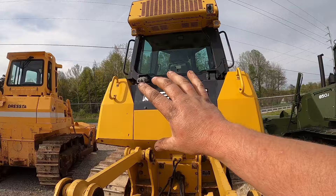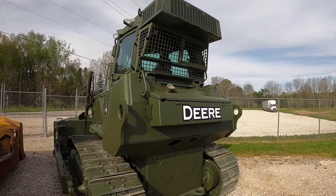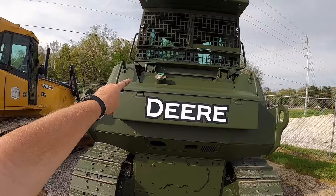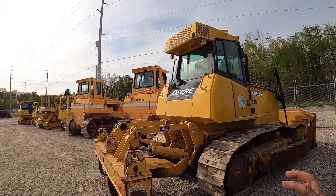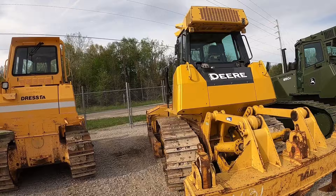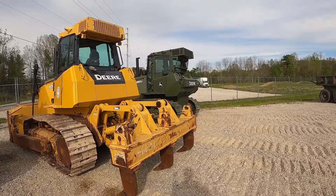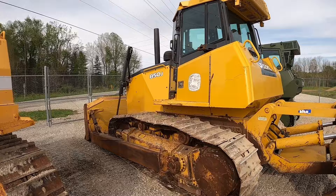Another difference is the fuel tank. On the military unit the cab mounting bolts are welded to the fuel tank, while on the civilian one they're bolted on. The reason is that armored cabs have a different, heavier-duty mount, so they made them interchangeable by bolting. A regular civilian fuel tank will fit in one of these military tractors with a couple of modifications to the holes. We've had these machines apart from one end to the other — they're very easy to work on, the cab tilts up, and we have a large stock of new and used parts including new final drives.